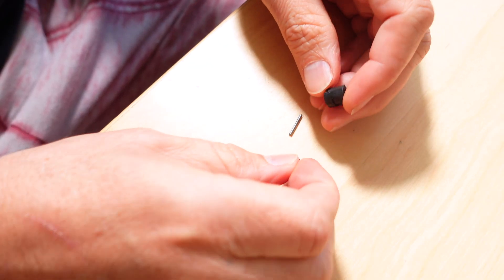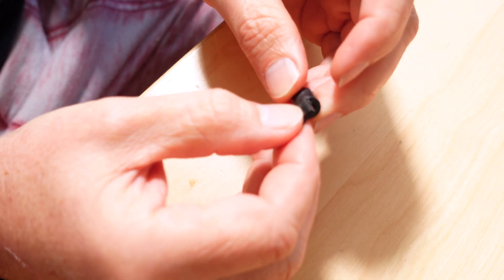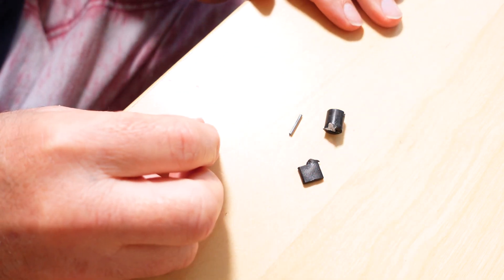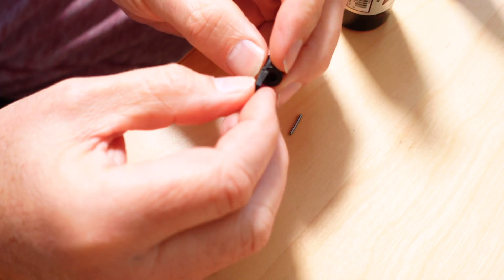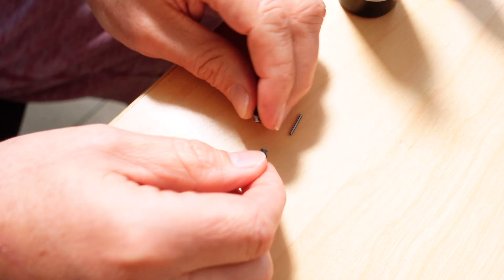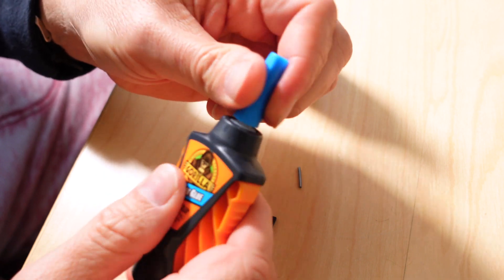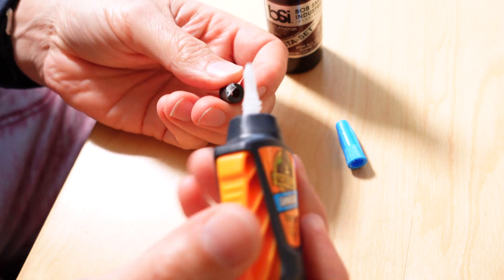We can see what we're going to have to recreate on our 3D printing platform. Before we do that, I'm going to glue this piece back together so we have at least a working model from which to get the dimensions we need to transfer into our CAD program. This piece needs to be pretty accurate dimensionally — otherwise it won't work. There's not a lot of tolerance in the area where that drive lever goes up and down.